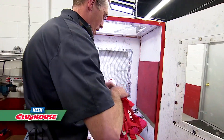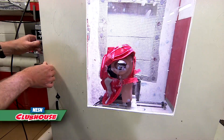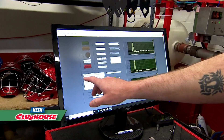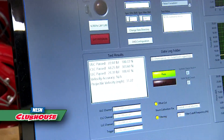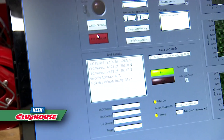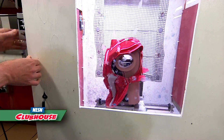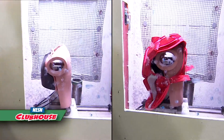If we add our chest protector — three, two, one. So now you can see here the sensor in the heart measured only 68 pounds, where with the bare chest it was over 150. So we've cut that amount of force that would be going through to where your heart is by more than half. This is down to a safe level and we know that somebody who's wearing this would have a much lower risk of being injured if they were to get hit with that same baseball.